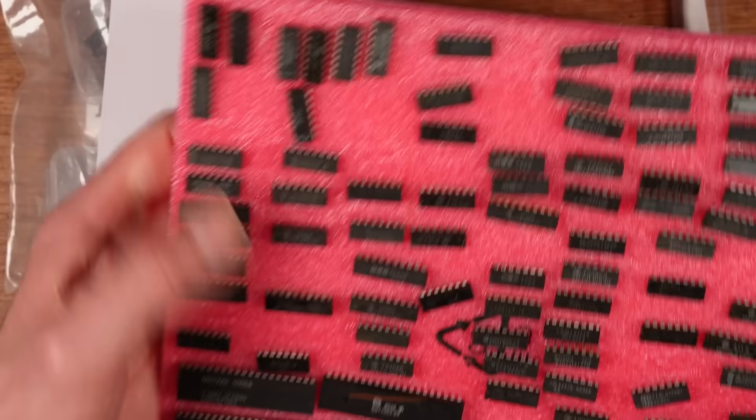Most of these are LS because these are all vintage chips. Anyway, this chip tester can tell the difference between LS and HCT. I can demonstrate this by popping a random chip in here from this stash without even looking at it. Pressing the enter button and it's not found it — this might be a faulty one. Yep, I found a faulty one. This is an LS00.